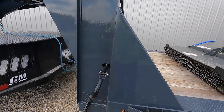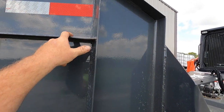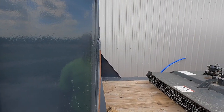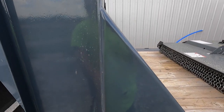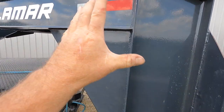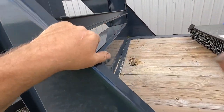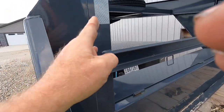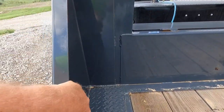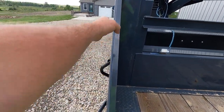Let's go over a couple things on this trailer. That's probably just from where they welded it. But you see this kind of bow — see how it's got a bow? That wasn't there before. I seriously think this neck is flexing, almost think it's flexing here. The back's going one way and this is going the other. Normally these are not eighth inch — normally you have something that goes in the middle of this I-beam, angled or whatever. I get it, they're trying to give you this pocket, but I care less about this pocket. I think it's bending.